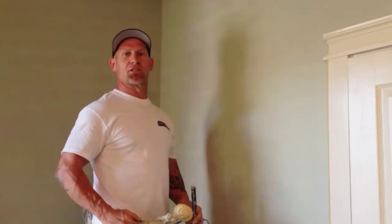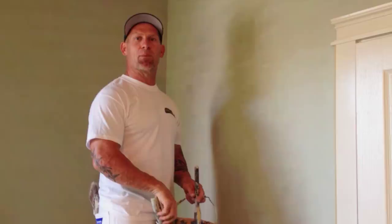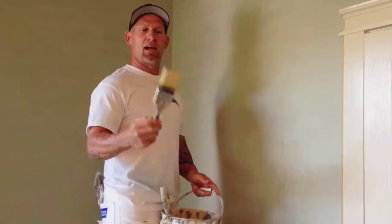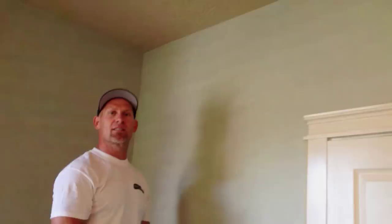In this video, we're going to go over ceiling cut-ins and how to do a proper ceiling cut-in. To do this task, we're using a 4-inch nap. I use a Purdy White Dove 3/8 inch, 4-inch nap, and I also use a Purdy Sure Tip brush. I like 2.5-inch angled sash brushes. We're using a product from Sherwin's called Treasure Valley Eggshell, and we're going to be cutting in the ceiling a different color. We're going to show you how we go about cutting in the ceiling.